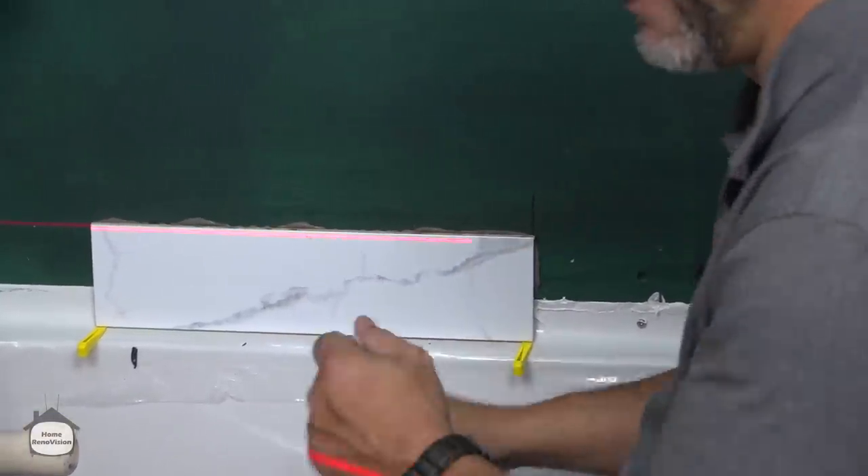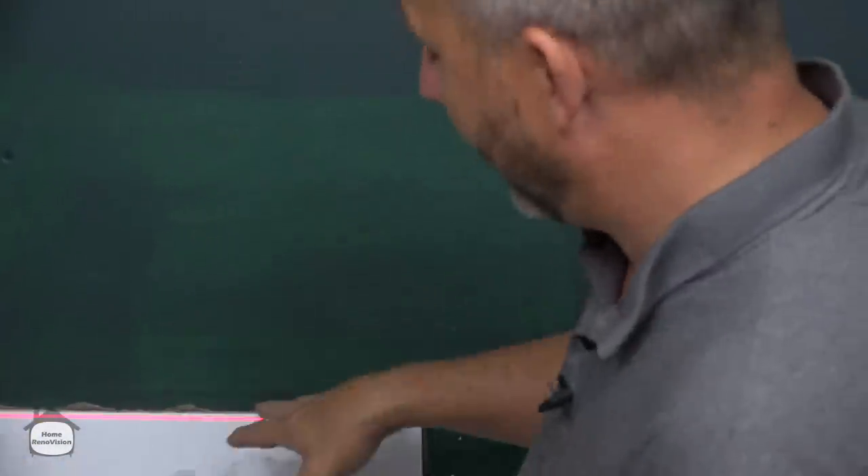Now I love it. Because it's sensitive due to the scoop, what I'm going to suggest is you tile the first row and — if you don't have an ultralight cement that'll hold the tile in place — let it dry overnight before you come back and build the rest of the shower.